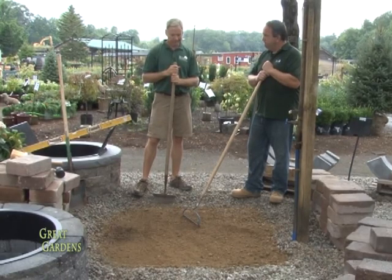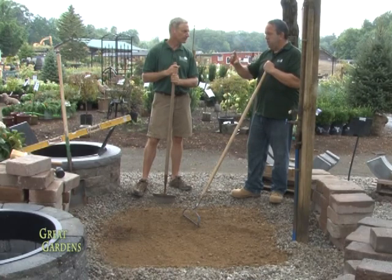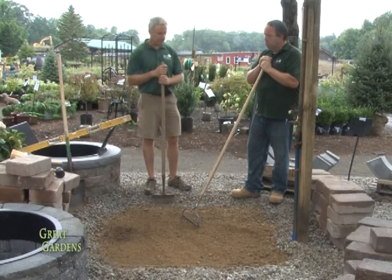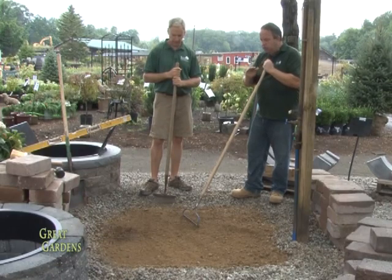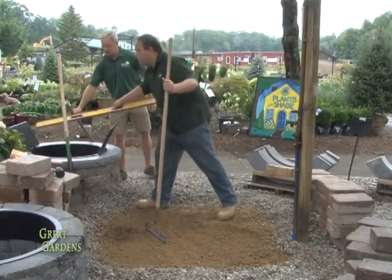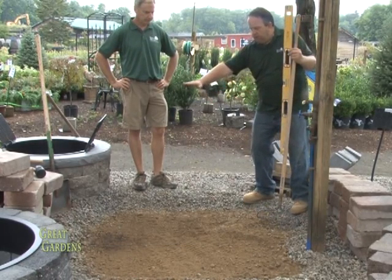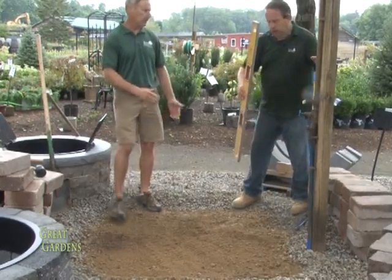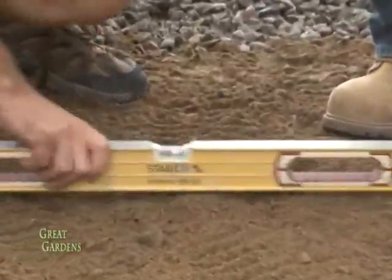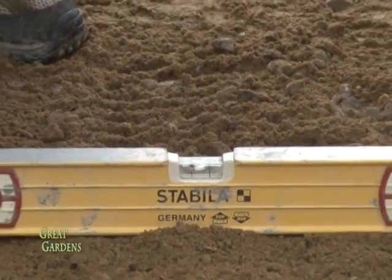And water is your enemy in this instance. You want to stay high and dry. We've removed a lot of the root mass in the soil and we've put in what we call dense grade — about four to six inches thick — to give yourself a nice drainable substrate. You've created a pretty level spot. What's next is you try to achieve as level a surface as possible, so it's worth taking out the level at this point. A large three or four foot level is one of the tools you need, or a simple piece of two by four with a smaller level on top works just as well to measure a larger surface.